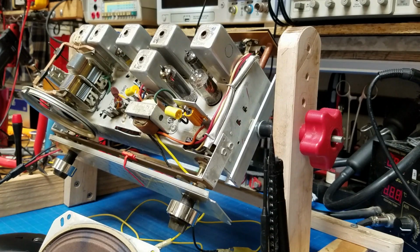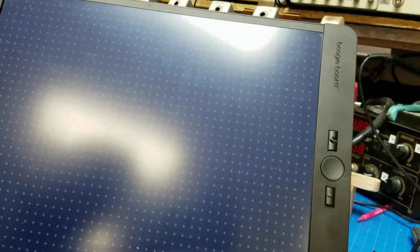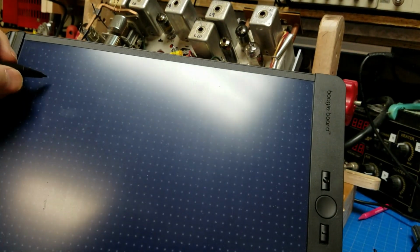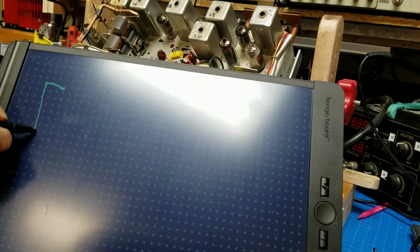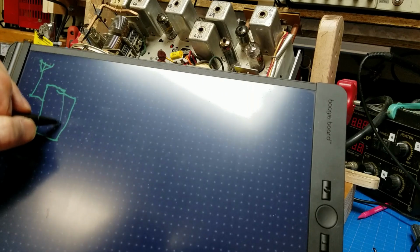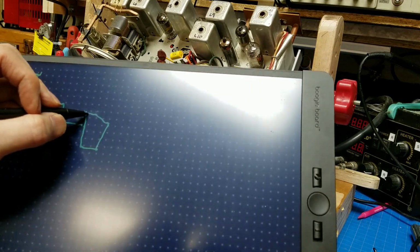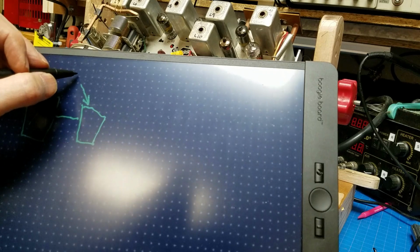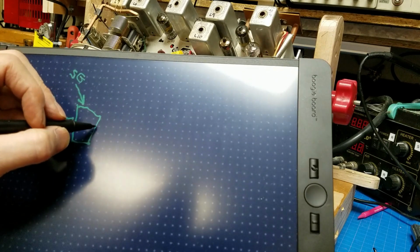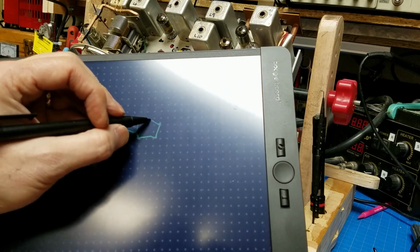Now, what we've done is we've gone through this radio and we've aligned it by coming in. I want to move you all back just a little bit, and we'll get out our little board here. But what we've done is we have the front end of the radio that is attached to the antenna, and we're skipping out on that section and the oscillator, and we're coming into the first amplifier sections of the radio, and we're injecting a signal into there with the signal generator. We then attempt to get a solid 10.7 signal all the way through each stage.